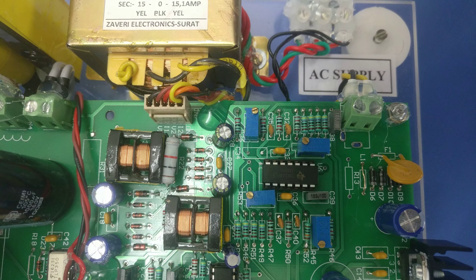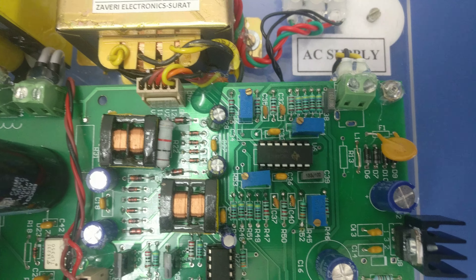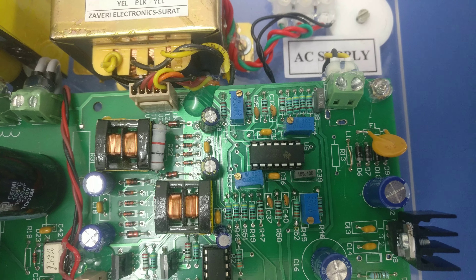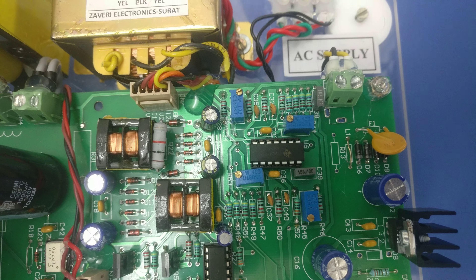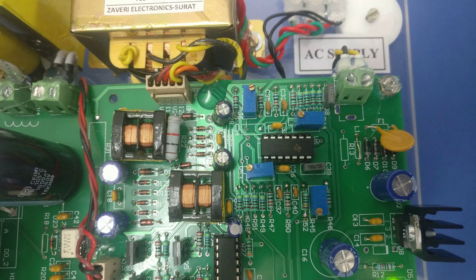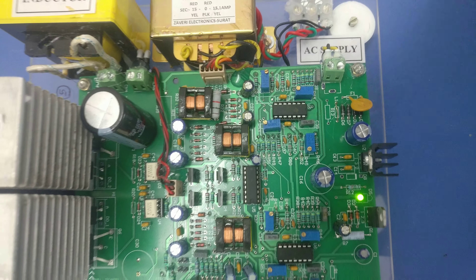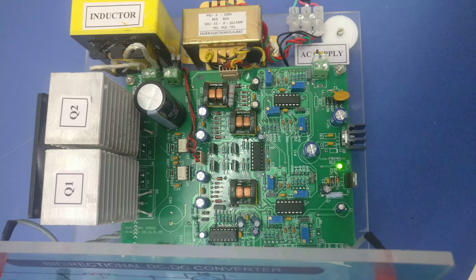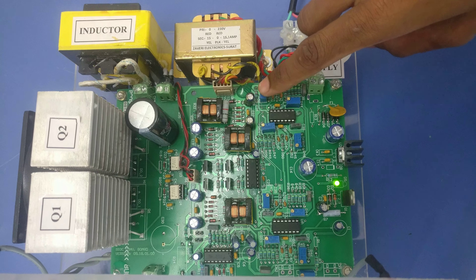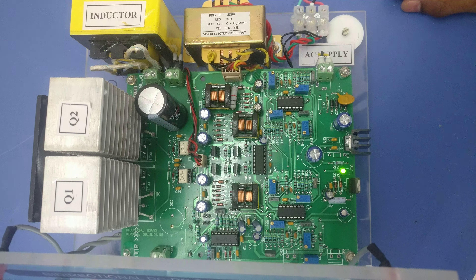By varying the offset port you can access your offset value — set to approximately 1.5V — because in bidirectional mode your current will be negative or positive depending on configuration. By adding a DC offset value you can connect your sensor output with your controller. Likewise, you can adjust the current amplitude and voltage amplitude to calibrate your input-output voltage and current range.